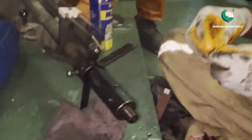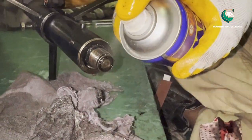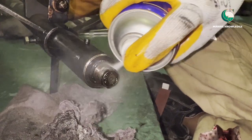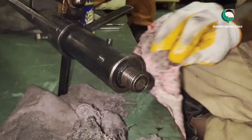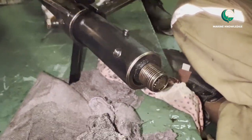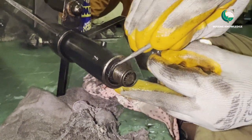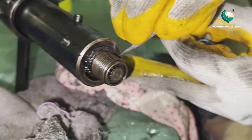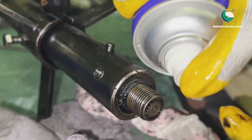Next we feedback. This is the pipe — the Sprayer Pipe — and you can see hard deposits of fuel oil near the threads. We have to remove that thick sludge which is on the tip. Again use a welding rod; you can see the fuel oil deposit coming out. These are all the things which we have to keep in mind when you do Burner Routines.